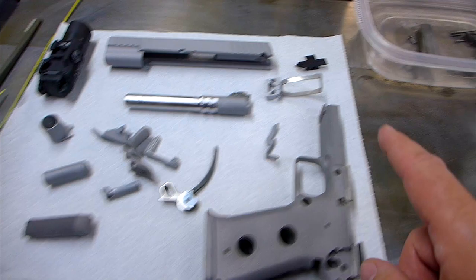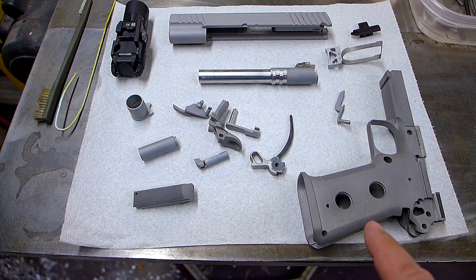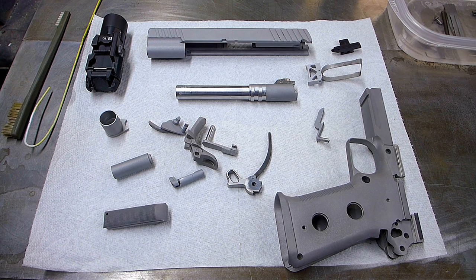After sandblasting, then I also clean parts with acetone as a final cleaning. And I'll heat these up because the paint will dry quicker with heat. I'll just use a heat gun, then I'll do the painting, and then I'll bake it in the oven.